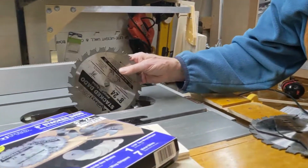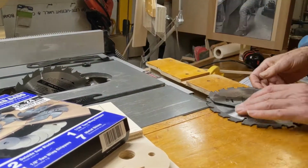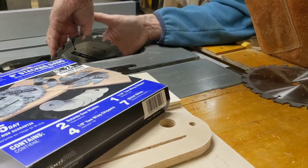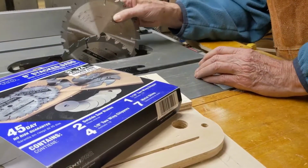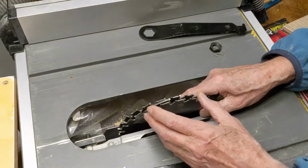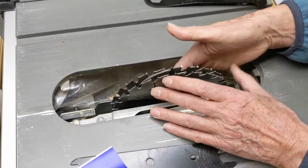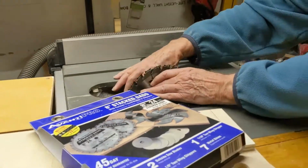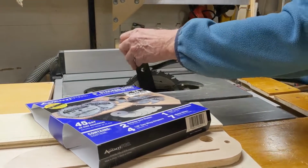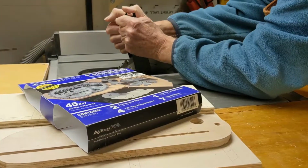One blade on the inside goes in. Then you've got these cutters that go on. Then you've got another cutter. All of these, like I said, are 1/8 inch wide. And then finally the outer piece. Now, when you line up these inside cutter blades, make sure that you don't get them on an outside cutter piece because you'll just get an inaccurate cut. Like I say, I never use more than 1/2 inch, and I'm only cutting out 1/4 inch deep in the dado. So now you don't have to get this over tight, just tight enough.